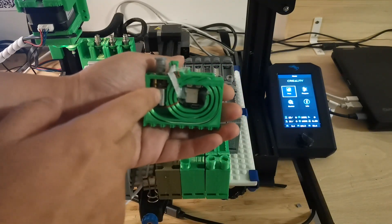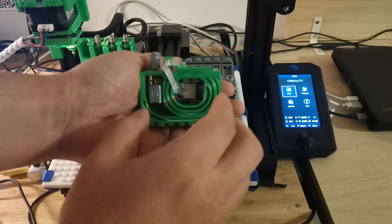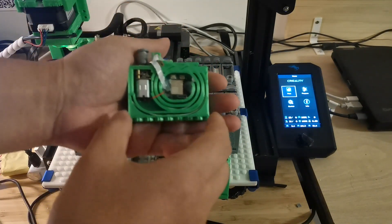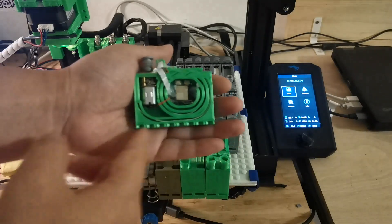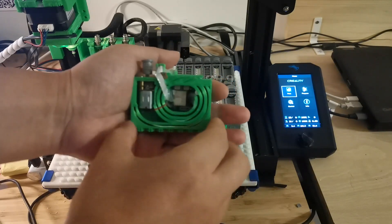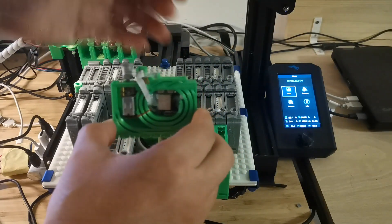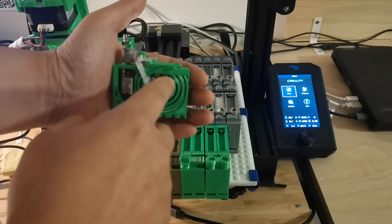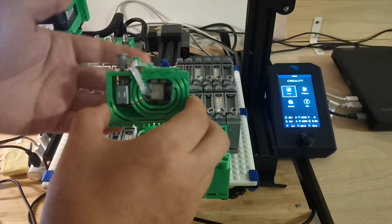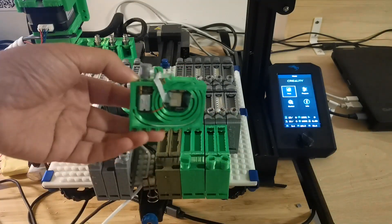The feature of this auto feeder is that it supports two millimeter and four millimeter pitch — you can switch between them. It also supports charging. Because of the limited space, I designed it so that we don't need any wires to use this feeder. It has a sensor, so whenever the nozzle tip comes near it will detect that and automatically advance the tape.